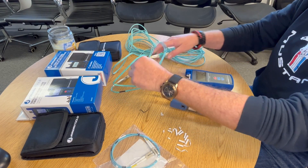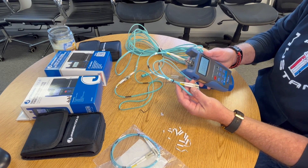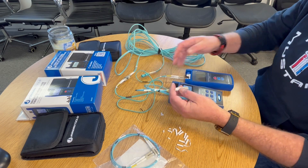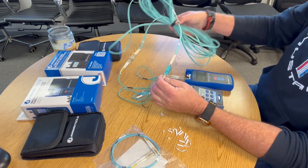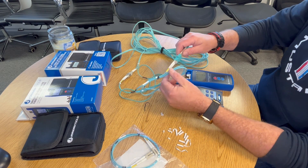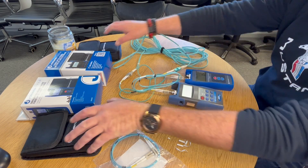We'll show you one or two tricks. In an internal training with our fiber guy, we found that shorter patch cables do not reference or zero out the meters properly — sometimes it works, sometimes it doesn't. So what we usually do is use a coupler and a long patch cable. From your endpoints, you've already run the fiber and tipped it, so try to have some couplers and longer patch cables — that should suffice.